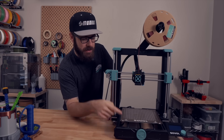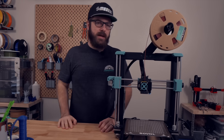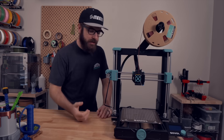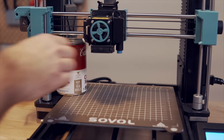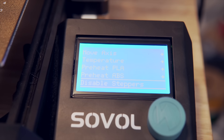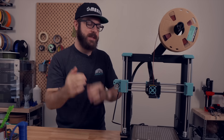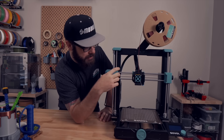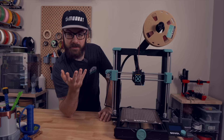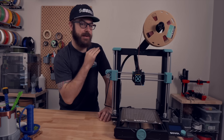Taking a deeper dive, I noticed the mesh was doing well front to back — the biggest deviation was left to right. So I grabbed two cans of Campbell's chicken noodle soup, placed them on the left and right sides of the bed as close to the Z-axis as possible, and lowered the gantry onto them. I could clearly see the right side was sitting higher than the left. I turned off the printer, manually adjusted the screws until both sides were level with the cans, ran the mesh and Z offset again — and it has been running flawlessly since.